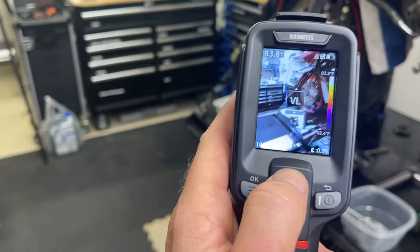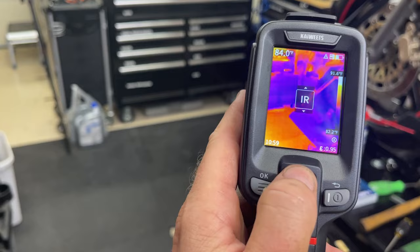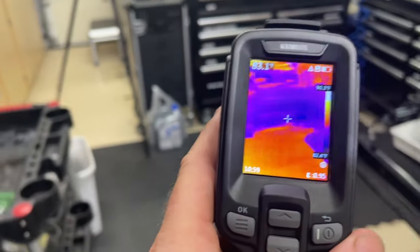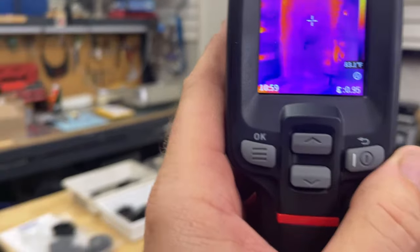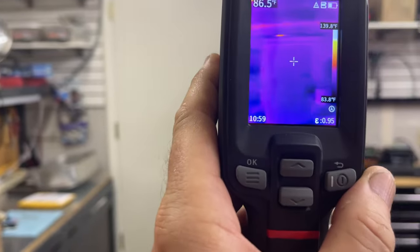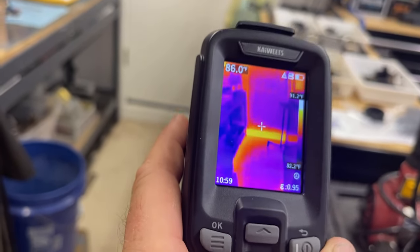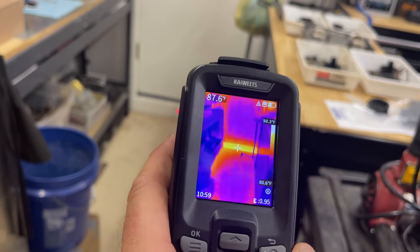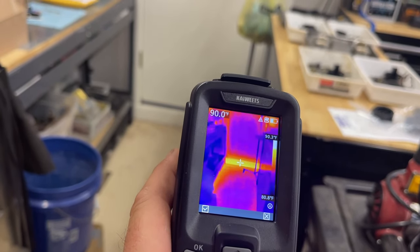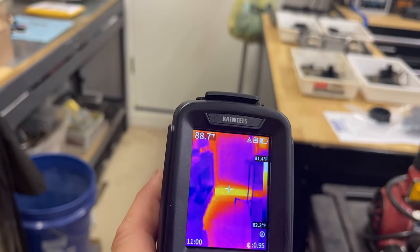Back to live - I think what most of us are going to use this for is the infrared where we're measuring temperatures of something. You can see all the heat coming in on the edge of the door - if that seal's not that great. And a lot of heat coming through that concrete. 90 degrees there, and at the bottom of the door 85 - so five degrees hotter coming at the bottom of that door. Interesting.